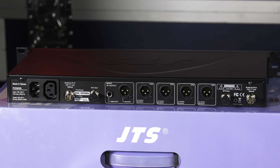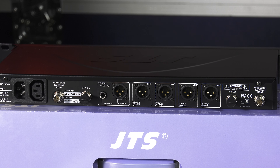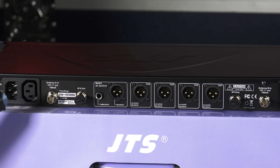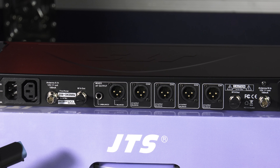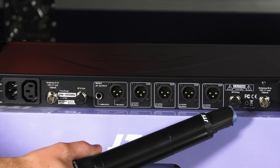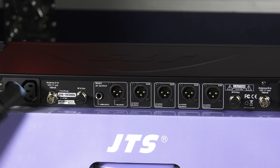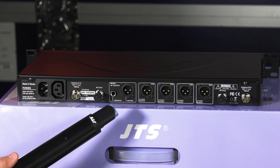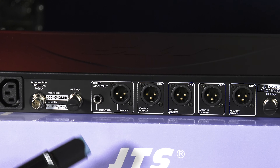We're now at the back of the unit. A few things to keep aware of — areas we've seen people have some issues. You have power in and power cascade out, which they include a jumper cable. Now here is where the antennas can get a little wonky. This is your antenna A and B for your quarter wave antenna. But if you were doing any antenna cascading, that would be done here. I've seen people plugging antennas in here and not getting any signal, and that's because that's not your antenna input. So let's say you had another unit below this — you would be syncing your antennas here and you'd only have one set of antennas on whichever unit you want. These are your individual outputs one, two, three, and four, and it does have a mixed sum output, which is this one here.